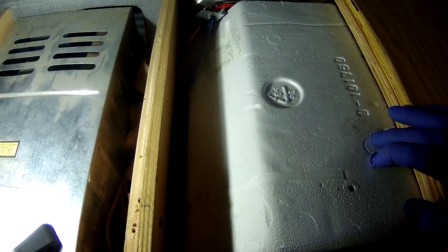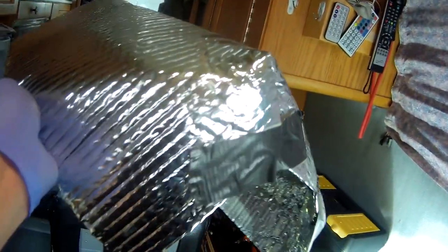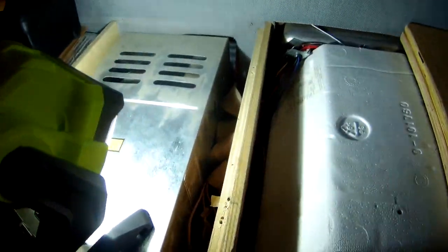I also need to determine where to mount the thermostat — I can either cut a piece here or up here. There are straps right here, so I'm going to cut it in there. I'll need my razor to cut it pretty precisely because I don't want to lose any heat. I'm going to put the Reflectix cover on top of the thermostat wherever the hole is, which should give me back some of my thermal efficiency.